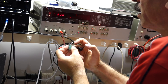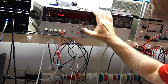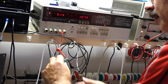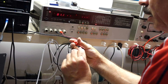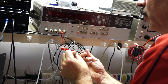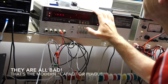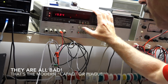The next one has an ESR of 33 ohms, which is better but still terrible, and a capacitance of only 5 microfarads. Basically those guys have evaporated — they're dried out. Bad modern capacitors. And this one, another supposedly 1000 microfarad cap, measures only 11 microfarads with an ESR of 15 ohms. So they are all bad.